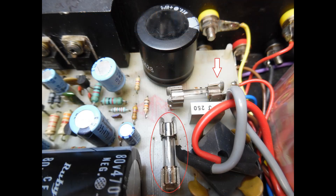I've highlighted two of the power supply protection fuses — these are T2A, time delay at 2 amps. The first issue, which is very common with these fuse holders, is that over time the end caps don't make a direct connection with the fuse ends. With the speaker output fuses, also T2A, you can get intermittent loss of sound, and just moving the fuse slightly will reconnect it. The fix is simply to remove the fuse and squeeze the ends of the fuse holder with long nose pliers, then snap the fuse back in firmly — a common fault to watch out for.